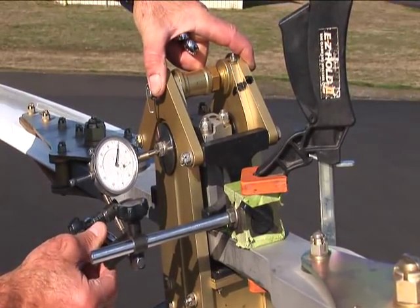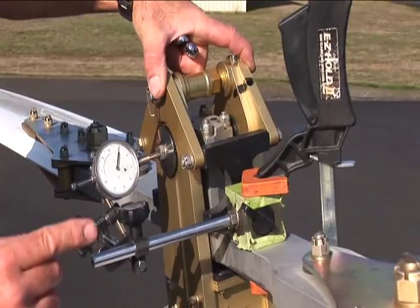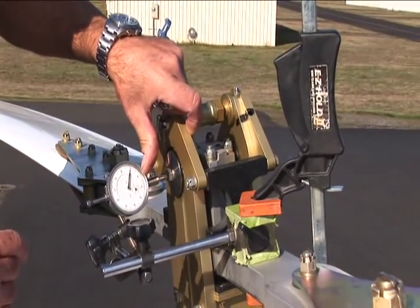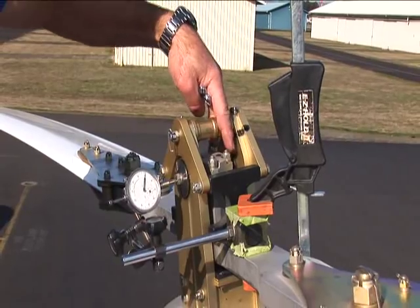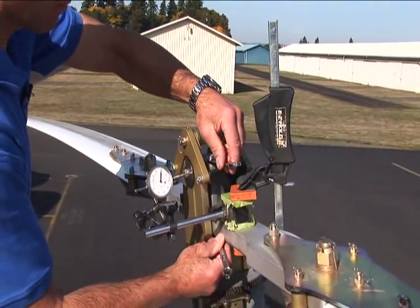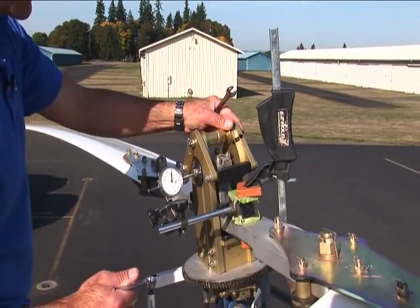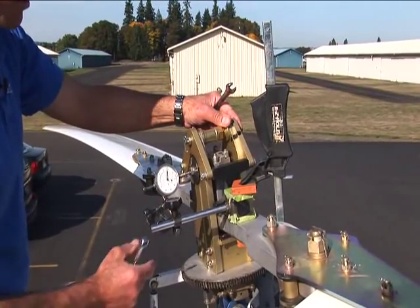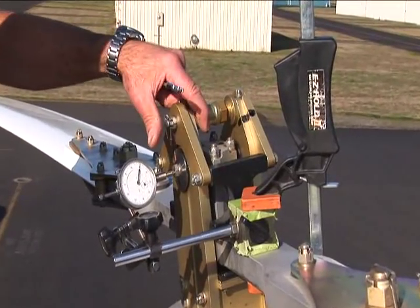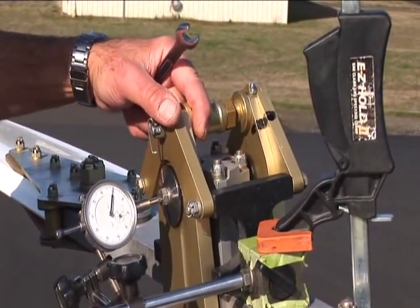This gives you a measurable amount. On a big 30-foot blade, if you see one inch out at the tip, it's ten thousandths of an inch of adjustment to correct that. On a 25-foot rotor, you'd see a five-thousandths adjustment — that's just that much of an adjustment for every one inch out of track. You'll tighten this side and loosen this side; put end wrenches on, reach underneath and hold it, give it tension, move approximately a flat or two, loosen the other side, and make sure you're snug. Check it with a torque wrench to confirm proper values.